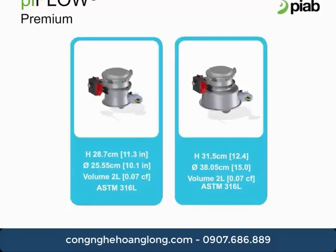Our most compact conveyors are often used for tablet press applications or small dedicated batch pharmaceutical projects. They also use our coax technology for the vacuum pump, and they have a compact filter cleaning system. The piFLOW C2101-120 has a 1.5 or 2.5 liter batch volume. The piFLOW P 2 liter has 2 liters of batching volume.